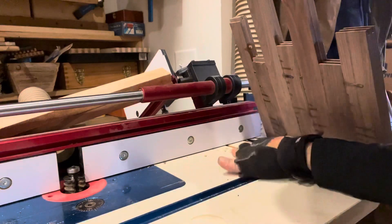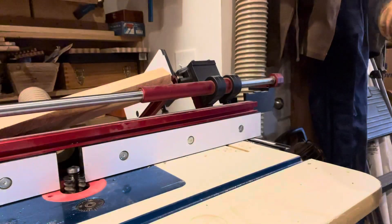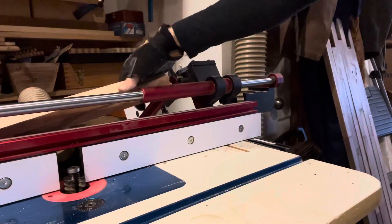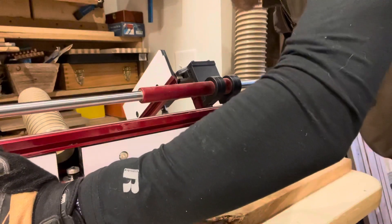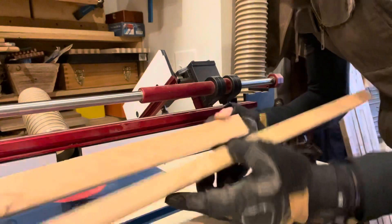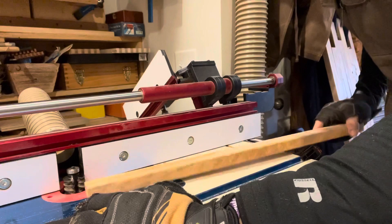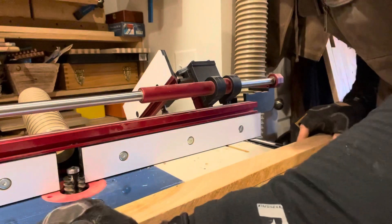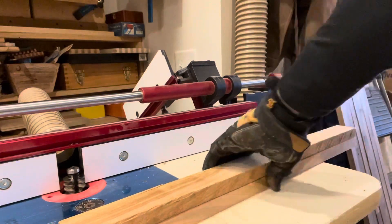No cheating — I haven't already set it up. You can take all of your shorts as a craft and hobby or whatever you do and make some pretty cool stuff. I've got all of my finger joints pretty good — it's not flush but I'm going to plane this down because I'm actually going to use it to build a box. I brought out a couple scrap pieces of cherry. You can finger joint this way but you're going to lose three-eighths of material every time you do the cut. Or you can do them end to end — I'm going to demonstrate end to end because it'll be easier to show.